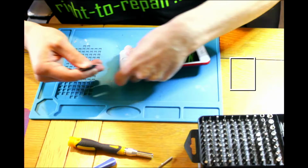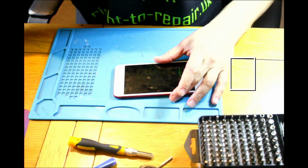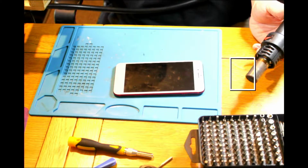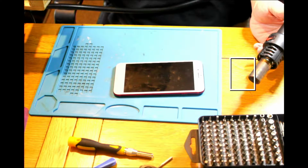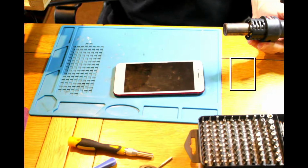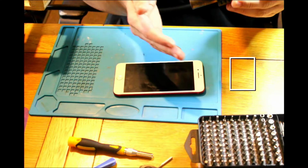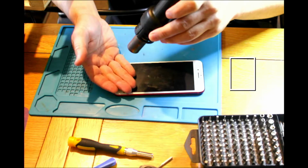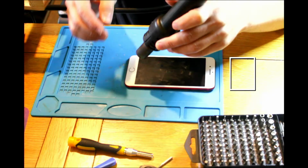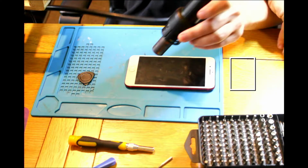But yeah, I can't. So I'll put the hot air station here. I'll get the suction element and I'll be right back. Okay, so I'm back. Let's get the hot air. Airflow, I would say about 50% airflow, and temperature over 50% on my one. Okay, that will be about the distance. Get prepared with these two.